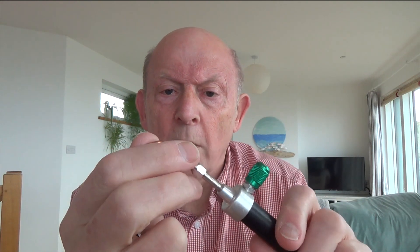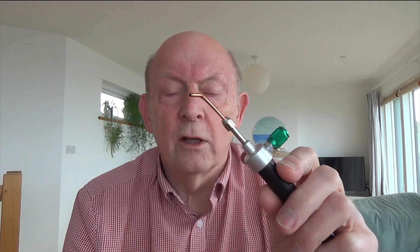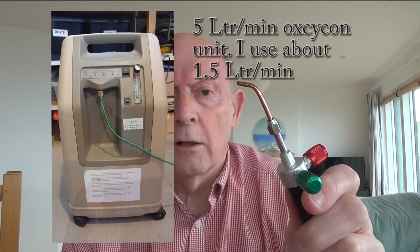The torch comes with five nozzles. I'm using one in particular and I'll tell you more about that in another video, as I've made a small change to it. If you've got one of these and you're not using it for any reason, the problems are easy to deal with. If you're thinking about buying one, I would say get one. I'm using it with Calor gas — that's propane — and an oxygen concentrator, and it'll also run with acetylene or any number of fuel gases. I'm totally smitten with this torch. It's already become my favourite, and I've got three or four torches including an oxy-acetylene torch. But this is so lightweight and so powerful, I'm over the moon with it.